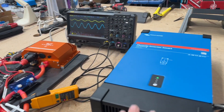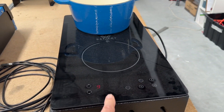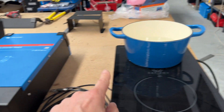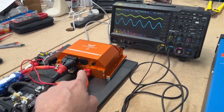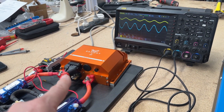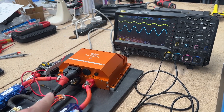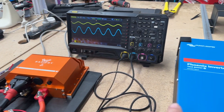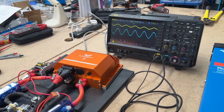Hi, Bruce from Safari. What we're doing here is running a 12 volt inverter — it's 3000 watt capable. We've got the induction cooktop running on setting 9, so that's only 1800 watts at the back there, but we're pulling the inverter and the induction through the 12 volt pin of Scotty from the 48 volt test batteries. This demonstrates what we've done several times before with 36 volts in a trolling motor situation, where the house battery is on 36 or 48 volts and you can continue to use an existing 12 volt inverter.